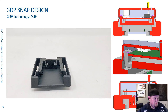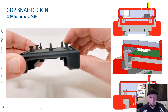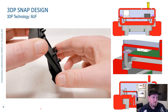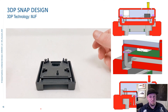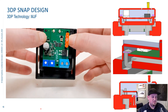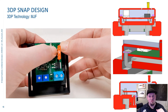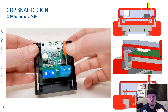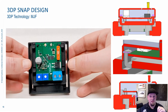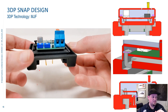This is an enclosure for a PCB board that is planned to be 100% manufactured with 3D printing. We did some really complex snaps that not only retain the PCB board, but also flex the other direction to keep the cap over top of the PCB. The idea with this design is to eliminate any hardware — no screws or anything like that — making it very fast and efficient to put together in final assembly at the factory.